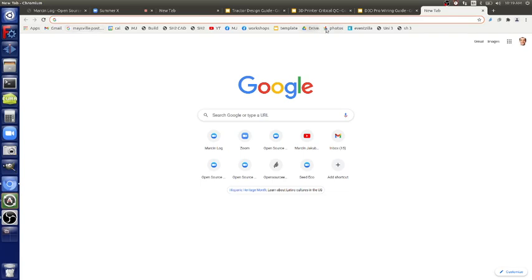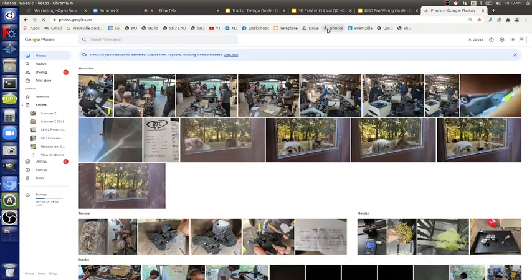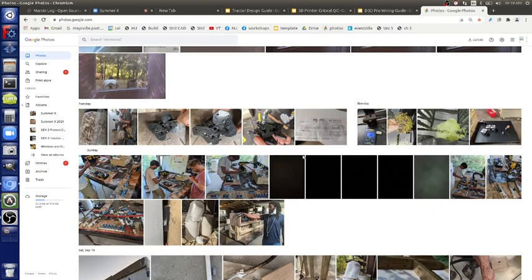And to be clear, is the purpose of that more accessibility in the future, or is there an operational issue? It's both. It's how you can access it to build it, and then how well it works. We're designing it so that you can easily get your wrenches in there. If you're in the know, you'll appreciate that we're trying to make bolts accessible. Engineers do not make bolts accessible. We're trying to pay attention to this. So if you have the head out, you can put an Allen key right there, as opposed to from the other side where you've got the other rods and the belts in the way. So that's the reason for it.